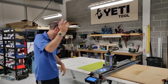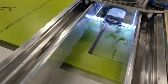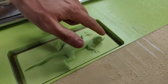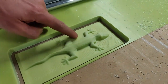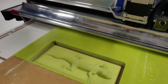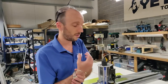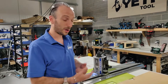Job's finished — come on, have a look! Check him out. He's not as furry, but that's a Corian thing. He's lovely. You can see the witness marks from the 3mm bullnose cutter there, which I quite like actually — it's kind of like a sand effect. And that's because we were using a 2mm stepover, which is huge really. If we wanted a smooth surface, we would take that right down to fractions of a millimeter, which we can do, but this was a quick cut to see where we could get to.